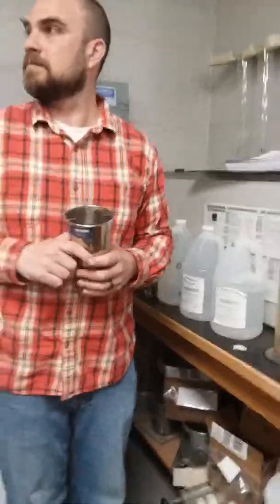So again, prepare your material based off of the makeup or the material type. Everything's passing our number 10 sieve. Either we have 50 grams or 100 grams. We're going to take that material, add our sodium hexametaphosphate to it, mix it up, and let it sit 12 hours. Once it sits, we empty it into our mixer, rinsing everything in, filling that up about halfway with distilled water, checking 60 seconds, and we mix it up. Then we put it into our hydrometer tube. Fill it up to 1,000 milliliters with the distilled water and let it equalize to temperature.